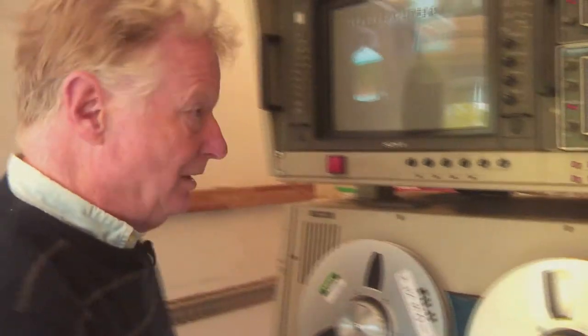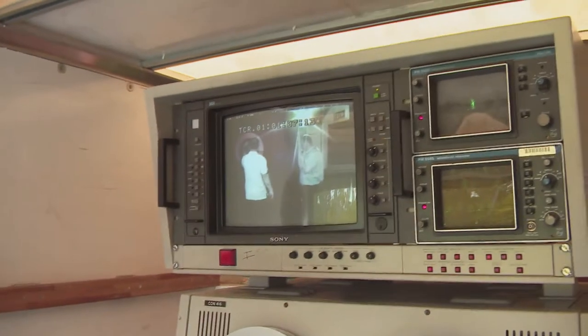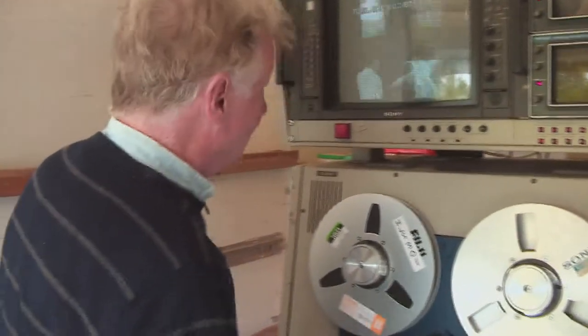What's that sound? That's tone. Lineup tone for the sound levels. It's 1 kHz, and it's the absolute international standard at a certain level and that 1 kHz frequency. So I must record it at the right level, and then again, when you come to line up for replays, people can tweak the sound level to get that spot on where it should be. Right. Next bit will be for real when we record the program.